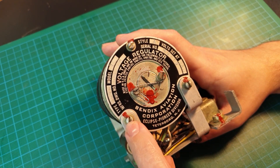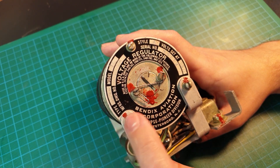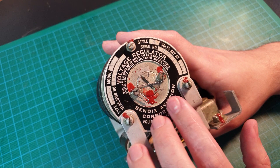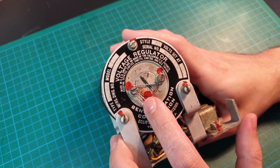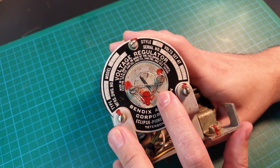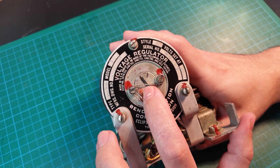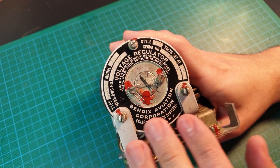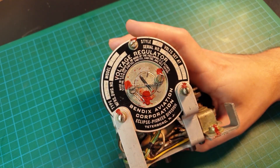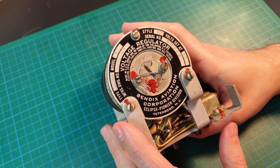The manuals cover everything right down to the configuration of the washers, lock washers, screws, even the torque value that you torque individual screws — everything is dictated in manuals. For example, this wire here — just using my eye, I think it's 20 thou lock wire, which is short for 20 thousandths of an inch. The manual will dictate how many turns or twists per inch you're allowed to have for this particular gauge wire. The manual also dictates what gauge wire you will need to use for what size screws or torque value of the screws. Everything is written in procedures right down to the minute detail.